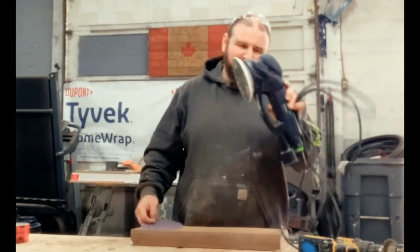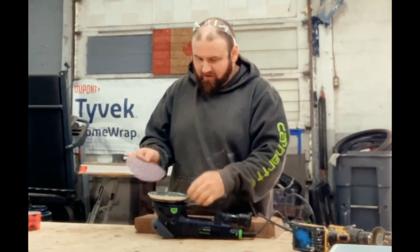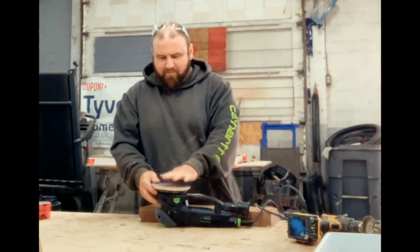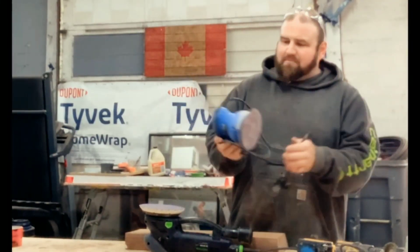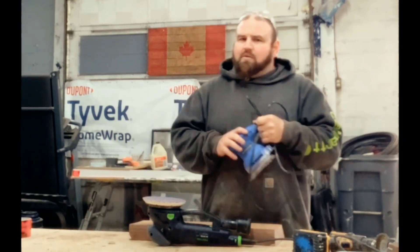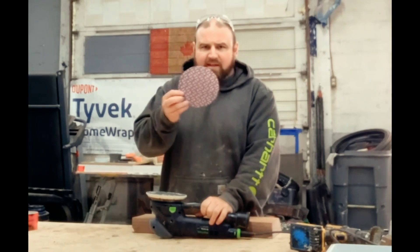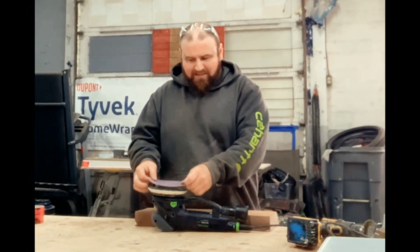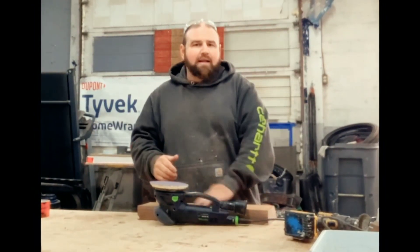Now I'm going to take my sander — I've got a Festool Rotex. It's a very good sander for getting rough sanding done, though not amazing for finished sanding on epoxy. You can also get it done with a little 5-inch Mastercraft; it'll work, just takes a little longer. I've got this 3M Extract sandpaper — it's really good because it doesn't clog up as much and lasts a lot longer. We're just scuffing up this wood so it doesn't really matter, but I've got it so might as well use it.